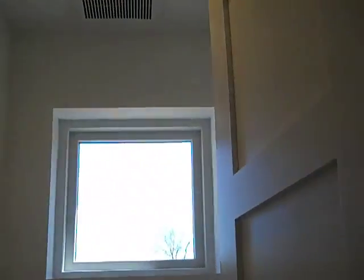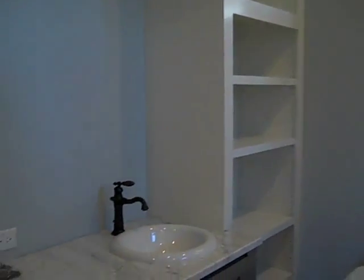We like to put all our fans on countdown timers if we can. In areas like toilet areas and shower areas, those fans need to run for a long time, so the countdown timer is really handy. You press a button, the timer counts down, and the fan turns off after a set period of time. In the master bath, you might be brushing your teeth next to your spouse and you don't want that fan drowning out your conversation, tempting you to turn it off before the job's done.